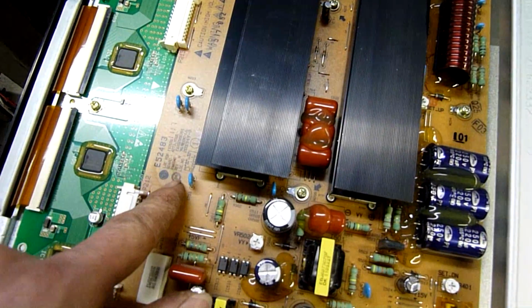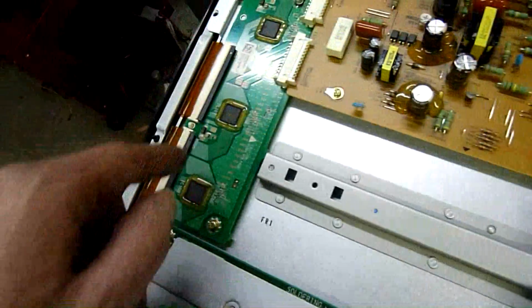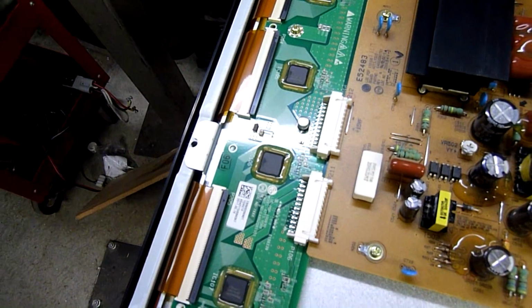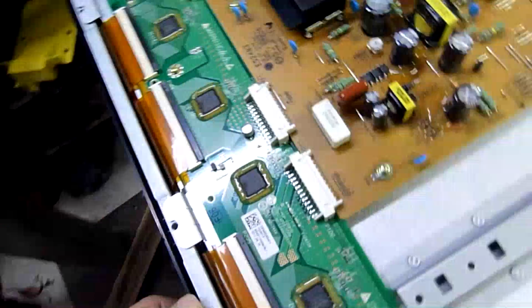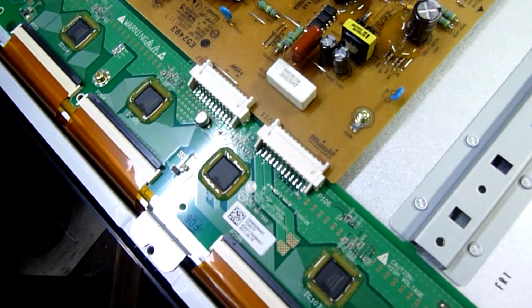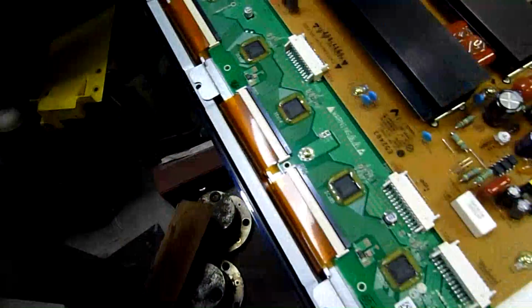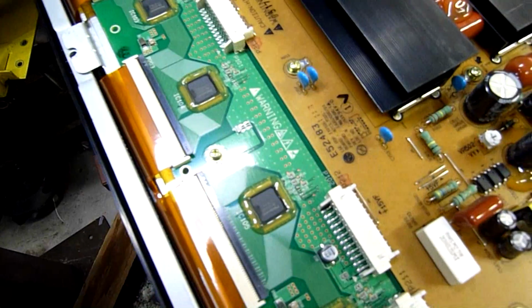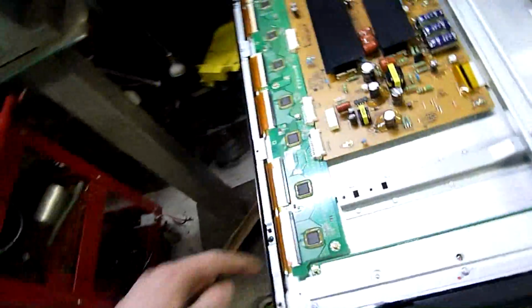Ysus board, part numbers. Notice it's just a single-sided board now. They're not multi-layer like these ones here, these buffer boards. Is it LG PDP 100830? Oh, no. Actual part number, model number is 42T3_YDRV. So the Y drive boards. Or single board, sorry. The chips on them are Panasonic too. Panasonic AN16638A. That's what these buffer chips are.